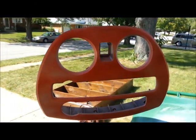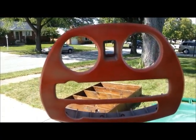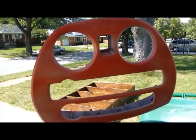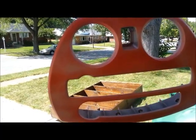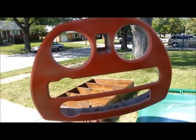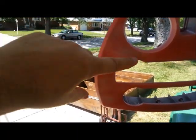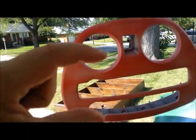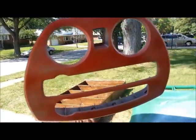To continue here, I've got one coat of both. This is using the Prevail sprayer. It goes on a lot thicker with the Prevail — the spray pattern isn't as good. Of course anyone that's used the Prevail will know that. You can see right in here it's got some white spots, because the Prevail doesn't give you a nice wide pattern. It's fairly narrow, it gets so blotchy.